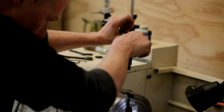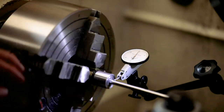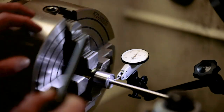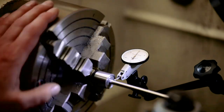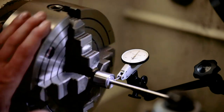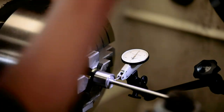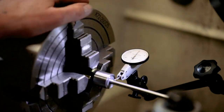As the jaws get tighter, the needle should be moving less and less. It's really not important that I have it on zero — all I'm doing is making sure there's no runout or deflection going on, so the needle could really be anywhere virtually on the dial. A couple more adjustments and we'll be centered up and ready to go.